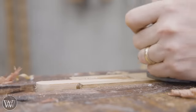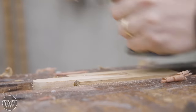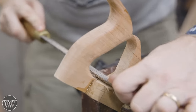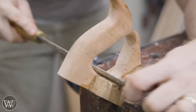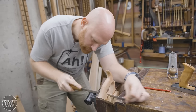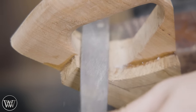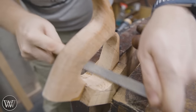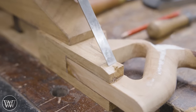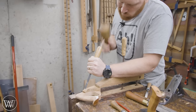This is a step I really enjoy because it's nice to get that clean, smooth transition. This will actually be the bed that the iron sits on. We also want to true up the bottom sole that will be glued down into the brass body, and transition between the two pieces inside. For the shape and how it's actually going to come together, there are lots of different shapes and traditions, each with a slightly different aesthetic. On mine, I want to do some more chamfers and pull from a couple different traditions.